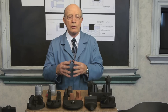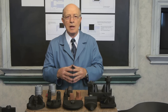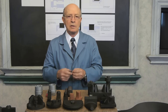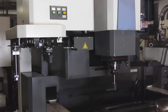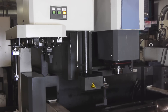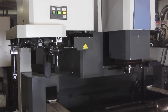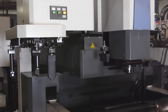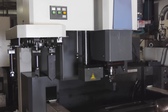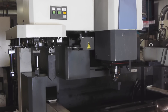I also want to show you another capability that we have with some of these RAM EDM machines, and that's the automatic tool changer, which is going to be demonstrated now in the next video. This is an automatic tool changer on one of our machines. We made this video to go four times faster. A number of electrodes can be placed into the tool changer, and the RAM EDM will automatically replace the electrodes according to the input of the programmer.